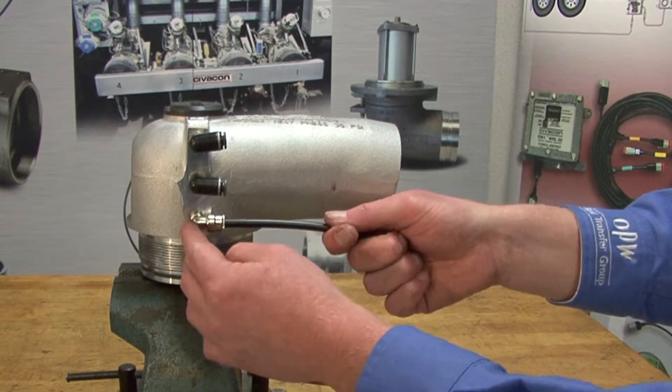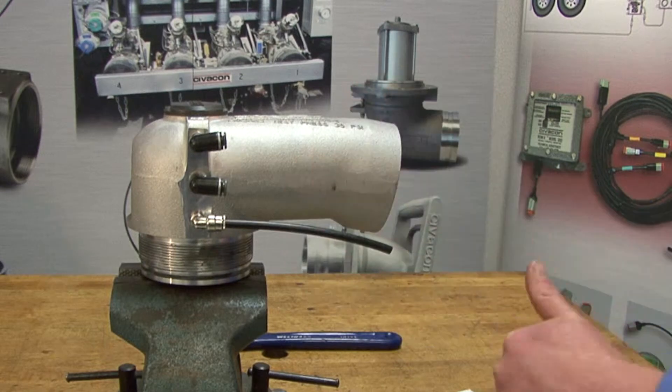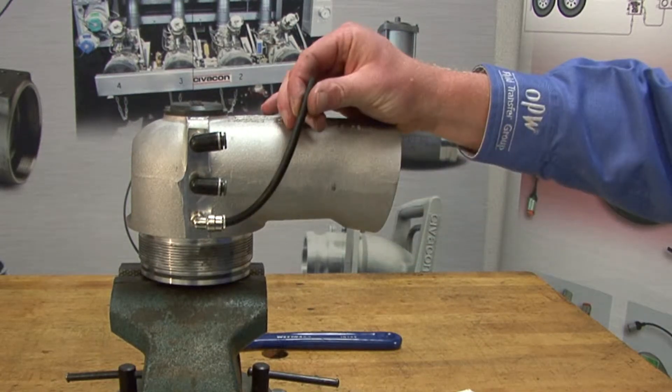Replace the O-ring in the O-ring groove of the flange. A five-inch tube is installed in the exhaust port at a horizontal or decreasing angle. Be sure the tube is not facing up or bent when installing.